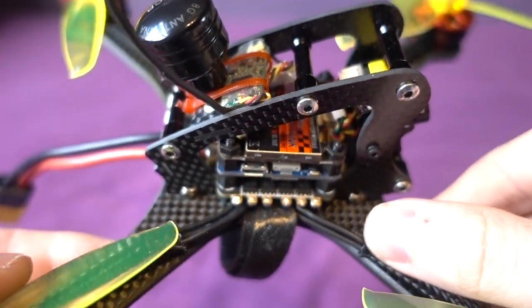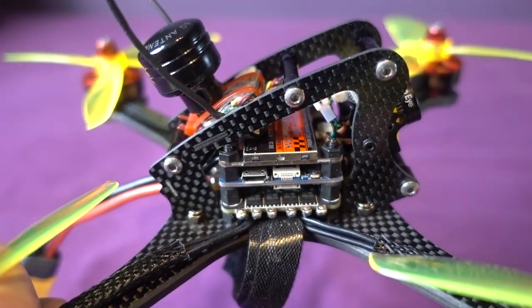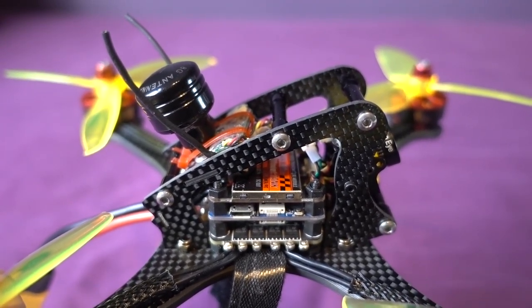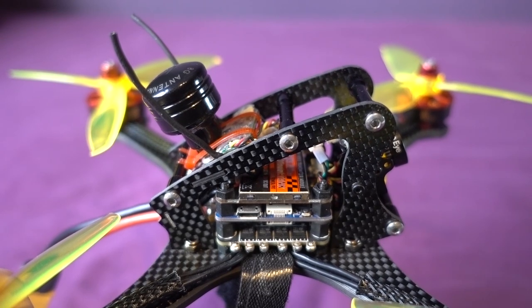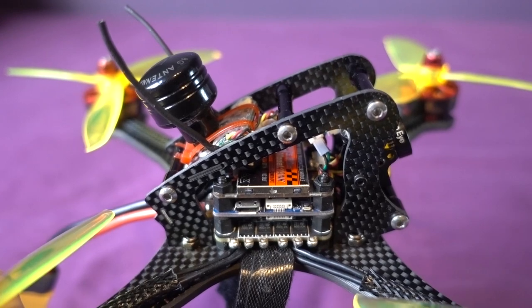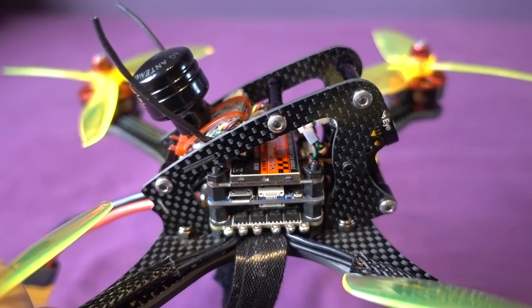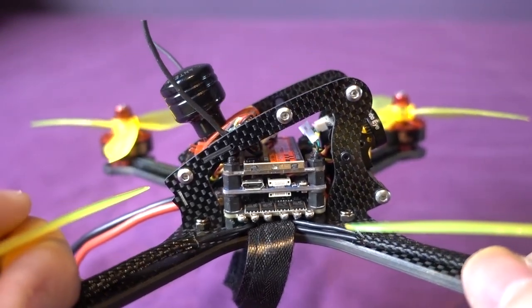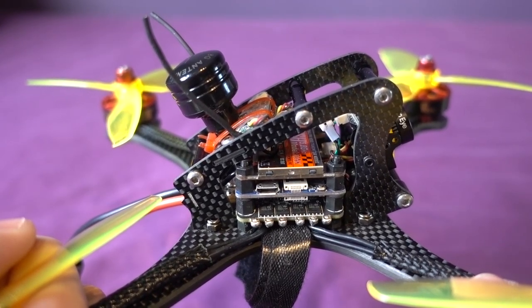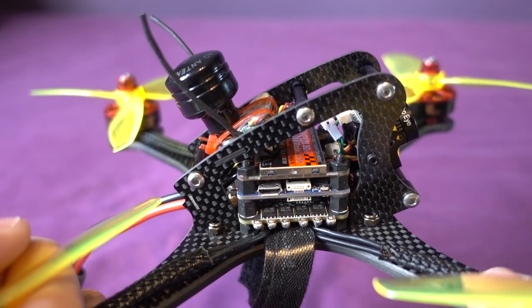But if you want to find more information on the VTX, then I will link to it in the description so you can read about all of the things that it can do, because according to the manual, it's got some unique tech in there. But it's more in keeping with a Freestyle VTX in that it switches via TBS Smart Audio with a power up to 800 milliwatts, although my Immersion RC power meter showed its max output at around 460 milliwatts, which is still respectable, and I think it's about what the Unify shows on those meters anyways.